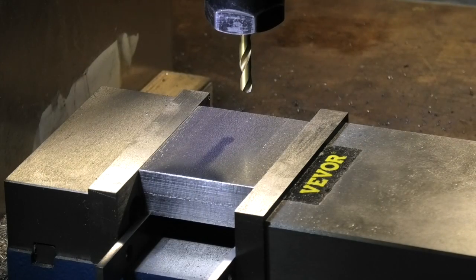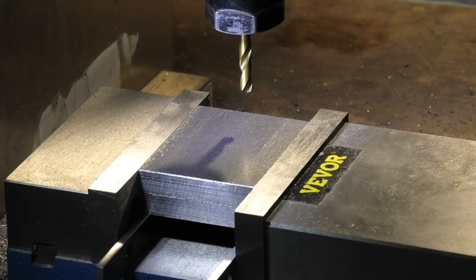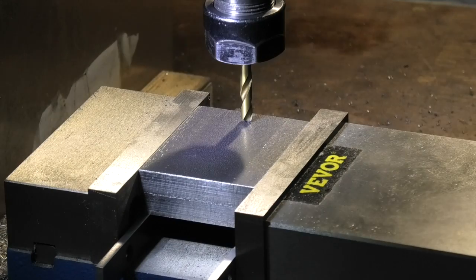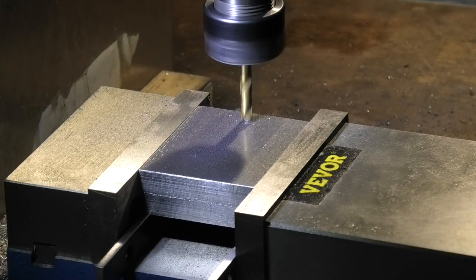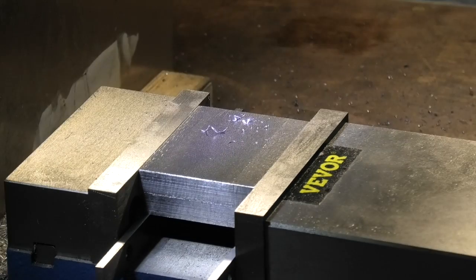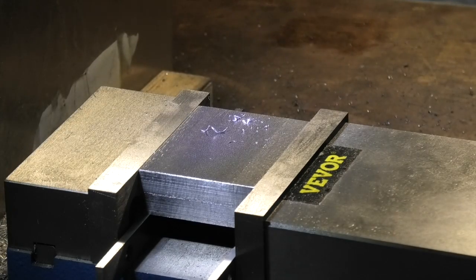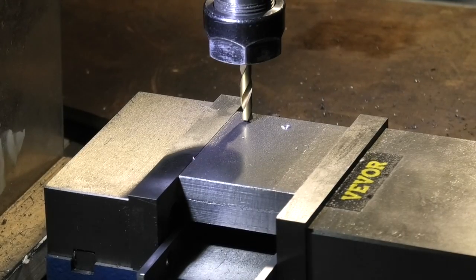My tool is a spot drill and I've moved it one inch down and it's 0.325 inches from the edge. I'll just spot that. Now I'm using that as my zero position - the other holes are either side of that. Move it across to the next position and just spot that.